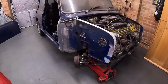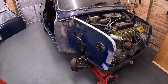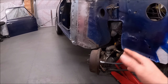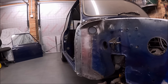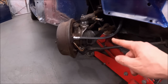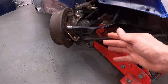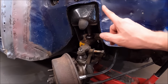Right, so it's the end of a pretty busy day today. I've been on it all day. Don't feel like I've got that much done though, to be honest. Although, I suppose to be fair, I've got all of that Flitch panel welded in, closing panel in at the top, everything done, the blanking plate back in, the suspension assembly this side. So I've done the top and bottom swivels, I've taken the shoes off, cleaned them up, put them back in, adjusted all the shoes up. We've got the new brake hose on there. We've got obviously the new suspension donut in.